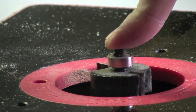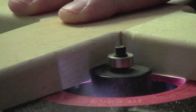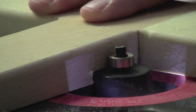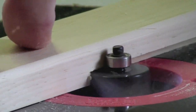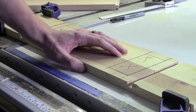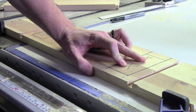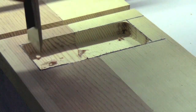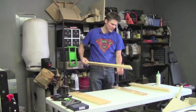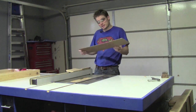Now we're just going to take a three-eighths inch rabbeting bit and go over the insides of those easels to make room for the blackboard and whiteboard. Now it's time to clean out the section right here on the sides to make room for the jut-out of the easel that this is actually going to bottom out on. Now I've just got to put it all together. We're going to cut the whiteboard to accept the trays to make the bottom and finish the tray out.